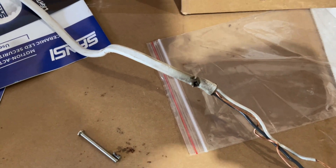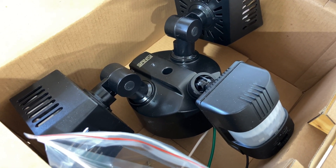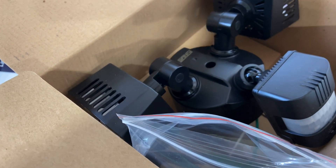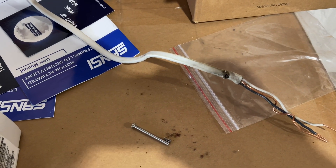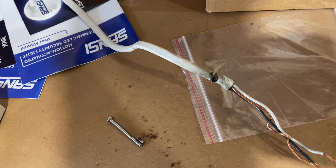So I was wiring up some more of these floodlights — you saw some of these in an earlier video — wiring two more up on the side of the place. Wiring up in very much the same way I did the other one, using a pancake metal box flush mount to the outside of the building and then basic normal wiring from there.